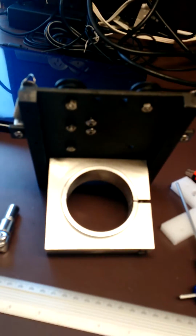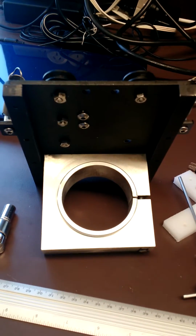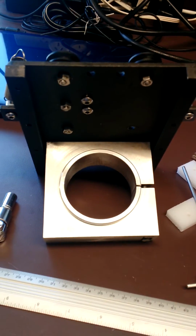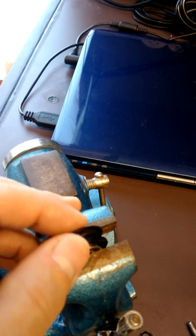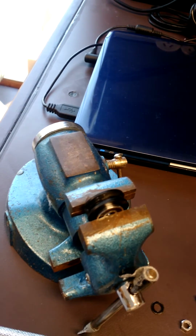And when you've got the Z plate further down its movement, just through trigonometry, a small amount of movement in that bearing is going to translate to a fair bit of movement in the plate, or apparent movement in the plate. It's not flex on the steel. I don't know if that was ever really a problem, but in my case, these bearings, don't know why, are the problem. Hope that helps some folk.